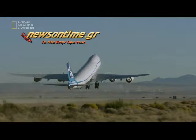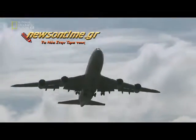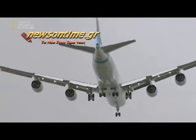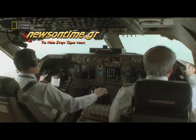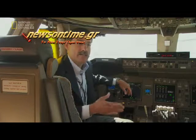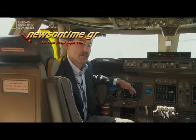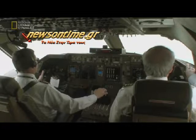Next, they put this new jet through the flutter test. Flutter is the aviation word for vibration. This test pushes fly-by-wire control to the limit. It's all high speed, generally above the ordinary envelope that we let airline pilots operate the aircraft at. And we vibrate each of the axes of the airplane by quite literally kicking the controls one at a time to watch how the controls react and make sure that the airplane, in fact, damps the vibration out to a quiet and smooth ending in a very quick fashion.